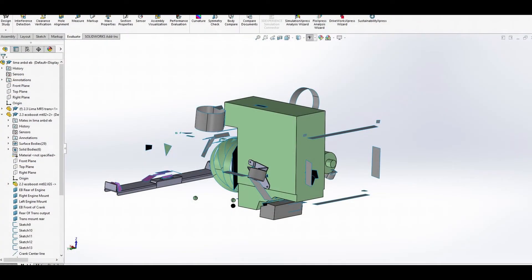Here we go into the CAD, which is kind of like a finished product. I just roughed in a block for the engine - didn't really care about the aesthetics, just wanted an idea of where stuff is interfering. You can kind of see where there's that gray cross member. The engine position shows where the clearances were on that, and later on we'll have to go in and do a custom oil pan.